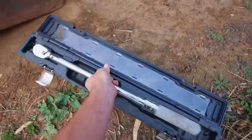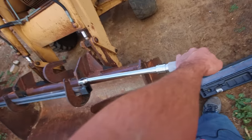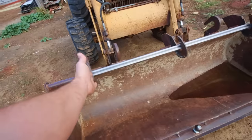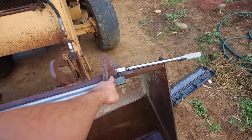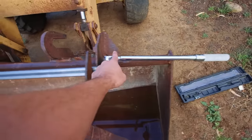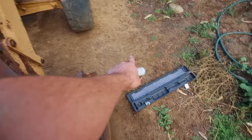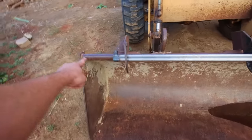I'm gonna set my torque wrench to 200 foot-pounds and put it into the 250-pound torque wrench hole — and there it clicks. So that is where a thousand foot-pounds is, and then there's five feet to the beginning of the actual torque wrench. We can measure with this scale: 200 foot-pounds of torque right here — how much force are we putting here to get 200 foot-pounds there? Then what is that force times the roughly five and a half feet to get to there? Distance times force gives you torque.